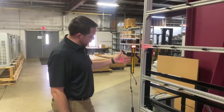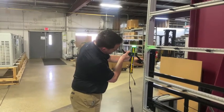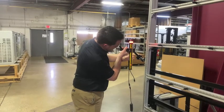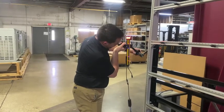So all I have to do is find my laser beam from the sender, which I left on — and here it is. I can see there's a spot right on the light curtain, basically on the bottom four blue LEDs. Then all I have to do is line that laser up with that spot on the light curtain.